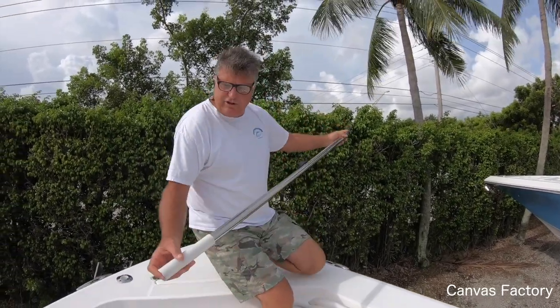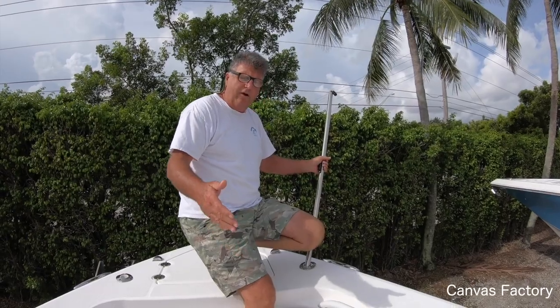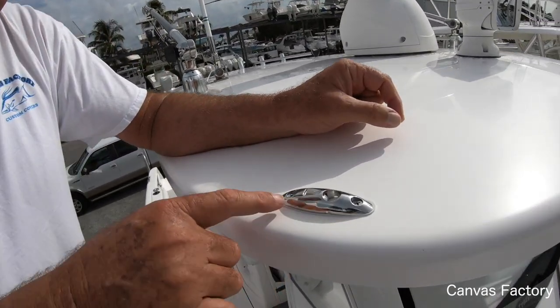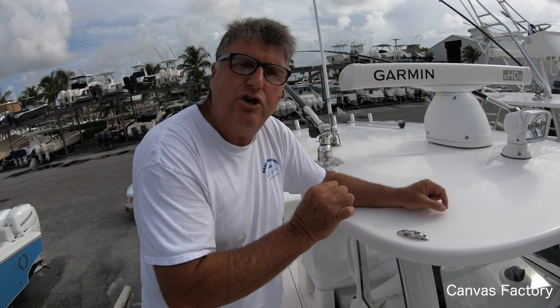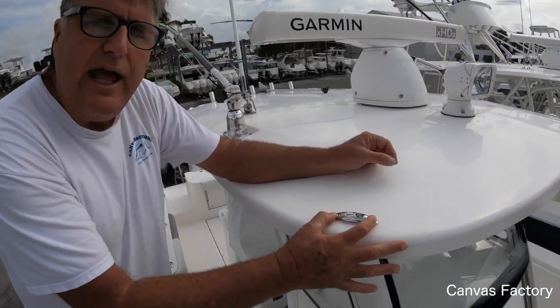You pull it out, measure that, and then I'll send you either two poles or, if you're doing a four-pole sun shade, four poles in a custom padded bag. I'll also send you the mounting hardware — all it is is two small screws. You drill two eighth-inch holes in the boat, countersink the gel coat so you don't crack it, then put a little bit of silicone in each hole. Place them right on the corners of the hardtop. After you've gotten your poles, there's a process — I'll teach you how to take the measurements so I can build your sail shade.